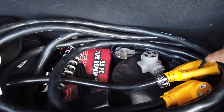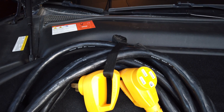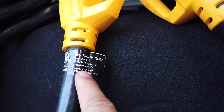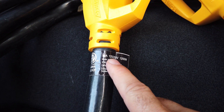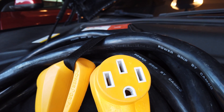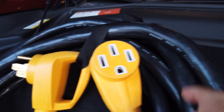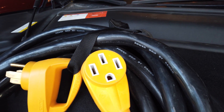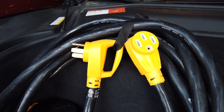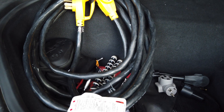The big cord is this one right here. This is a cord capable of charging the car on a 50 amp circuit. You can see there are some details right here on the side of the charging cord — it says 50 amps. The plug on it is a NEMA 14-50. This is the plug end of the NEMA 14-50, and then this is the receptacle end. I love using this extension cord — it's 30 feet long, and I'll include links to all of these adapters in the description down below.